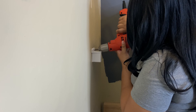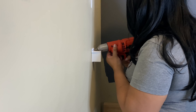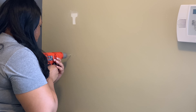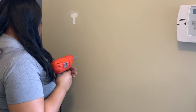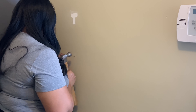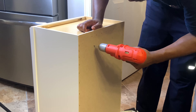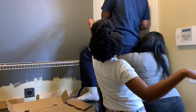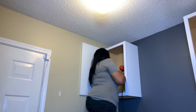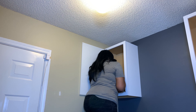Now I'm relocating the wire rack. These are the pieces the wire rack will actually sit in to provide structural support, so I'm adding them with my drill on both sides. Make sure you use a leveler so your wire rack will not be lopsided. I'm hammering anchors in because these are going into drywall. My husband is pre-drilling holes for the cabinets so it's easier to nail into the studs we already found. I got these cabinets from Home Depot.